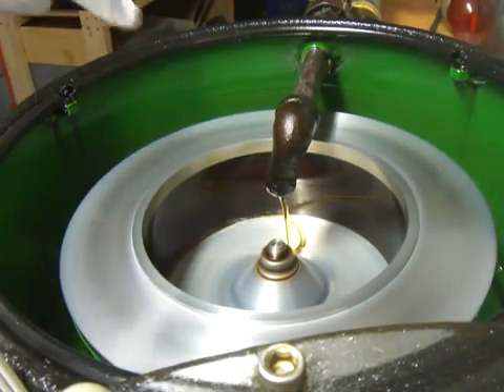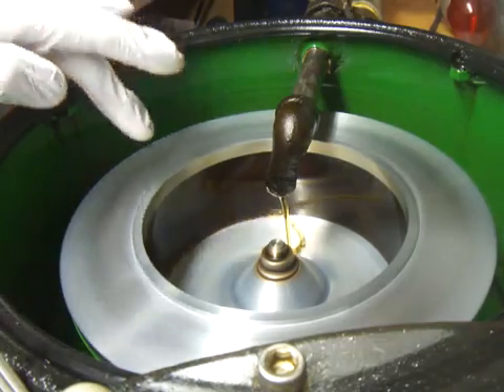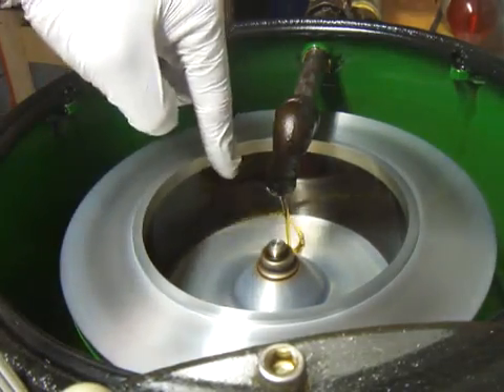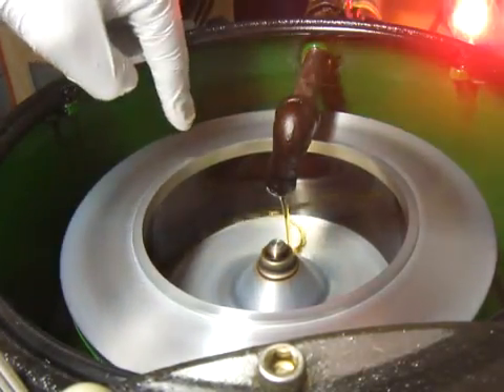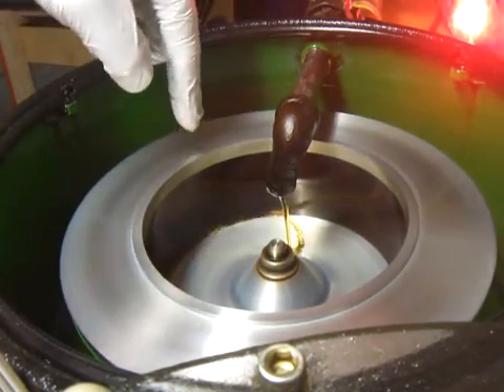You can see it now up against the outside wall. There's actually oil hitting it — you can't really see the oil coming over this edge, but as the oil hits the bottom of the bowl, you can see it being shot out to the wall of oil. It hits this wall and works its way up, and as it's going up, the water and particles separate out, and then it goes over this lip and gets caught in the outside container so I can then use this clean oil.